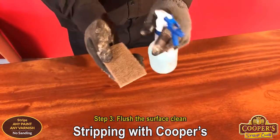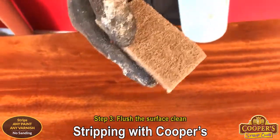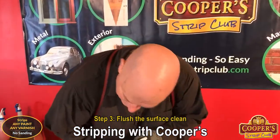This is a nylon-type pad. And if you see the sparkle in there, that's the grit that's been put into it. As I said before, this top is sanded by the person that made it, and by the look of it they did a really good sanding job. And this flusher — we want the little needles of the grit to get into the sandpaper marks that are left in the wood.